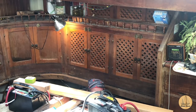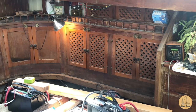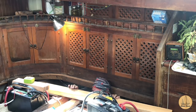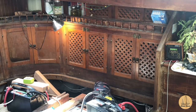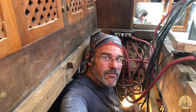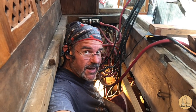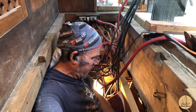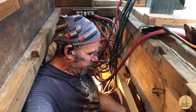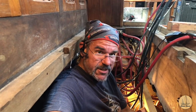Walking across the beams to get down here - I've got to make sure I don't hit the depth sounder wire. The sonar is down here and I don't want to mess the wire up. Sometimes boat work is all about the acrobatics. I've got myself wedged down in here - this is going to be the beam - I just have it temporarily sitting here and I'm going to try and dry fit some of these sections. There's another support just about four inches behind this that's been redone with studs and everything else, so I think that's really going to be helpful.